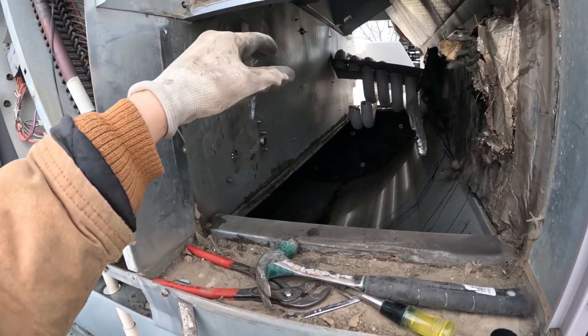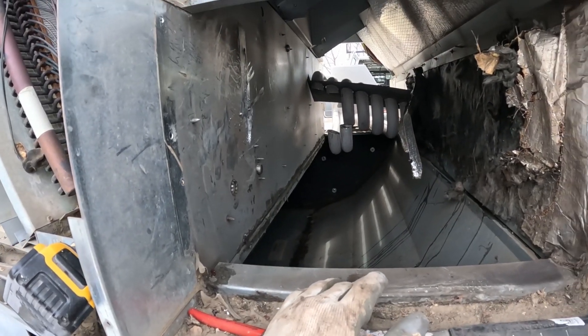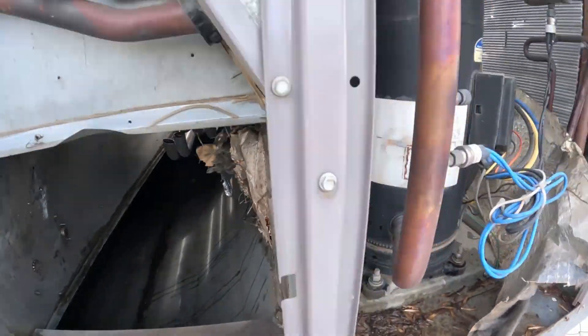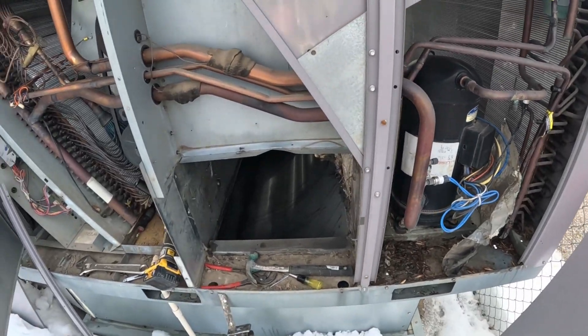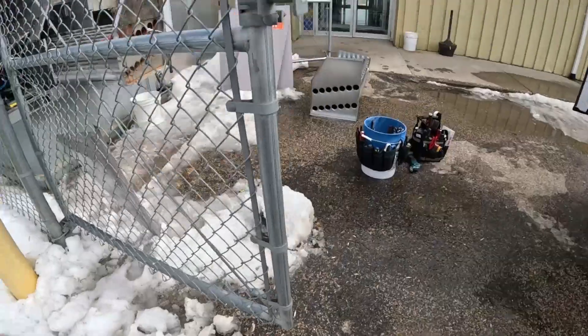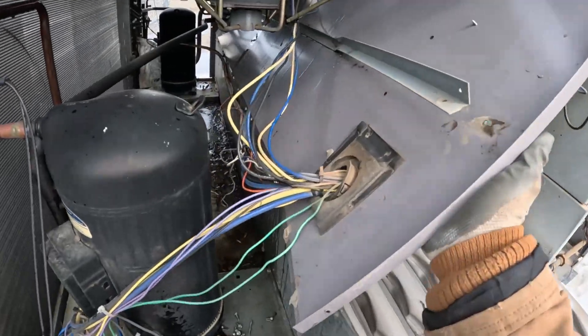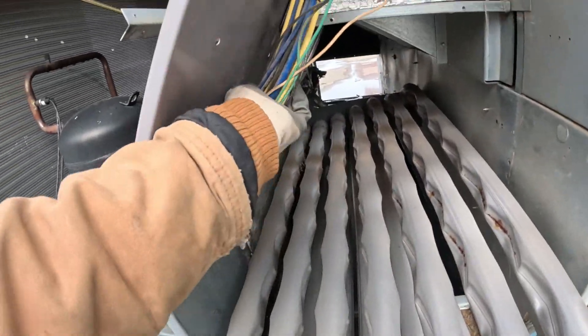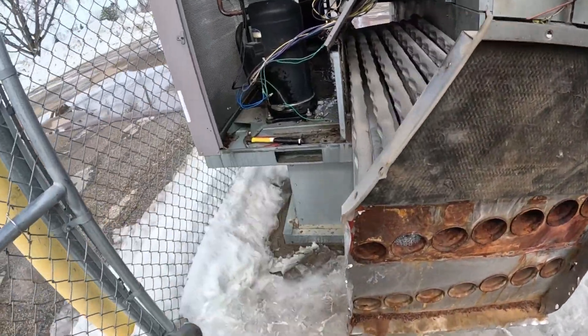It's important that we get the same height so we don't have water collecting in the heat exchanger. On this side the screws are located here and here for that end bracket — those ones are easy to get out. Of course we had to take all the panels off, so it's starting to look like some kind of tin-sign yard sale. Then on this end we had to take out this entire triangular piece and bend the support rib up because this wiring harness is in the way. Then we got the thing to actually slide out.